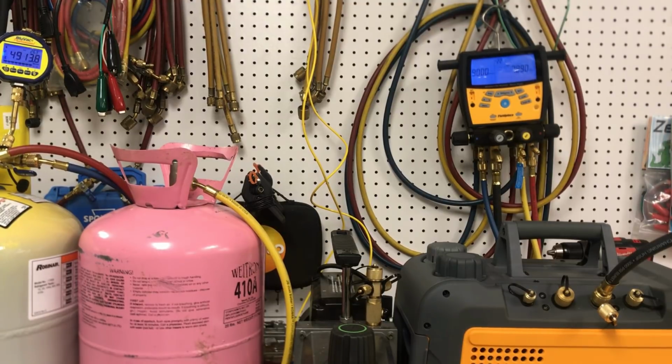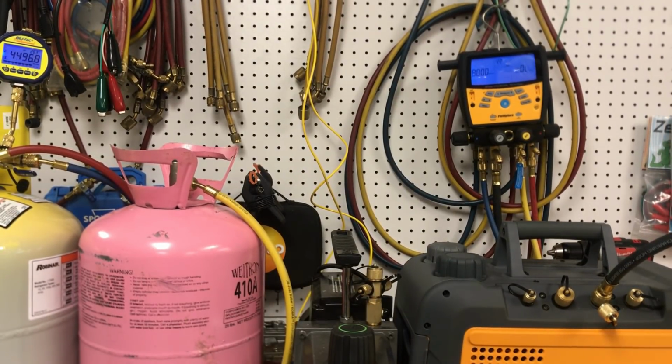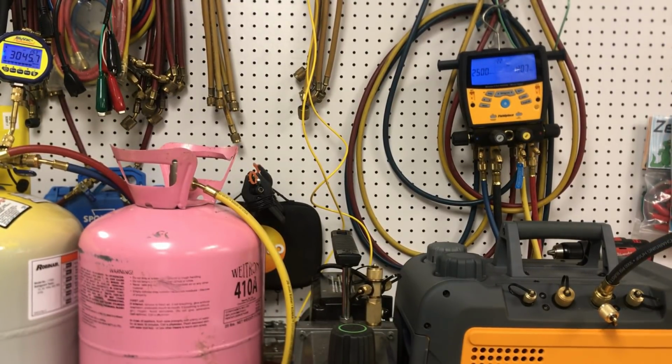Alright, the microns started a little over 2 minutes in. On the S-Man, they lit up at 9,000 and very quickly started down. It's at 6,500 now. Hopefully you can see that too. 5,500. Blue vac shows it's down to 3,500 now. So they vary a little bit. They get closer together as you get down into a deeper vacuum. We're about 3 minutes into it now at 2,500 and 3,000. So let's try to remember that and make a comparison when we hook up the other setup.